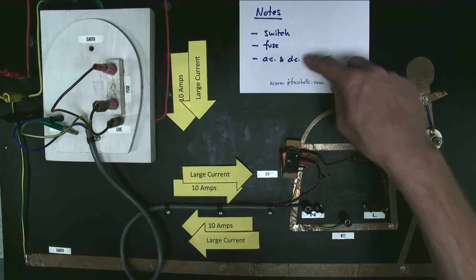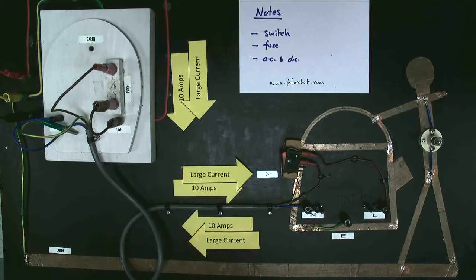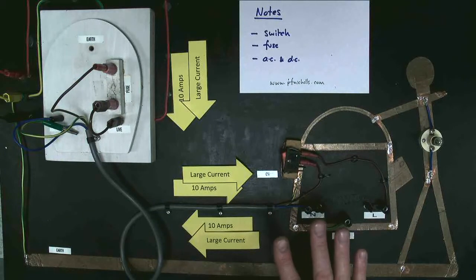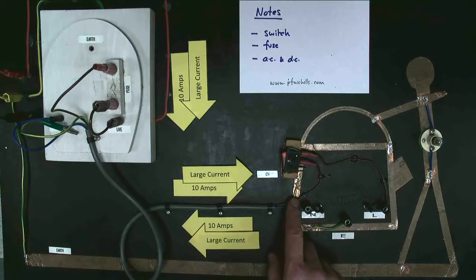The last point is about AC versus DC. In my diagram I've used arrows in one direction and red and black wires, which is what we normally use for DC. In the domestic situation it's actually an AC current — alternating current — so the current flows backwards and forwards along the live wire and backwards and forwards along the neutral wire. Exactly the same arguments apply. It makes no difference whether using AC or DC in terms of how the fuse and earth wire work. I've talked in terms of DC because it's simpler, but in the home the live wire oscillates at plus or minus 240 volts above and beneath zero volts, while the neutral wire remains at essentially zero volts. The arguments are exactly the same.